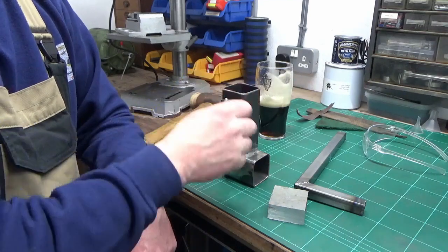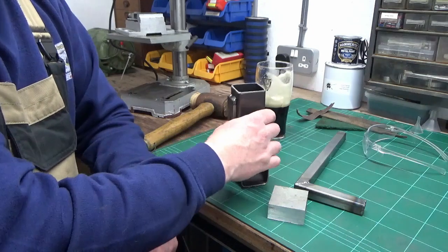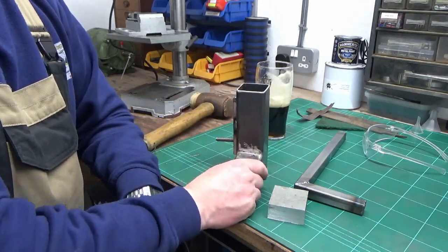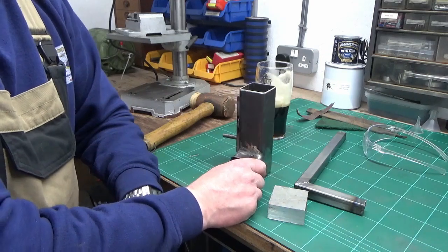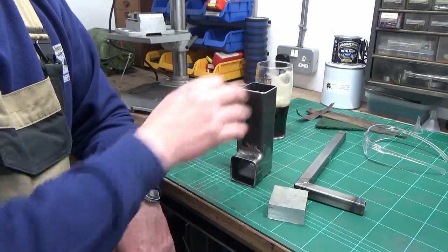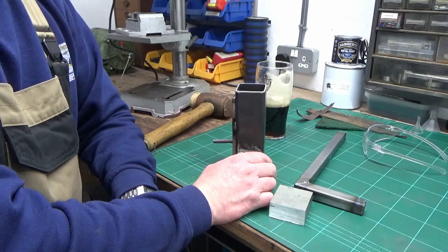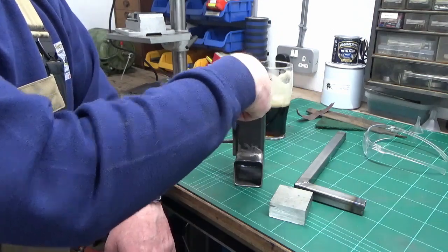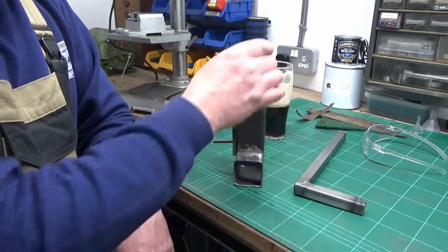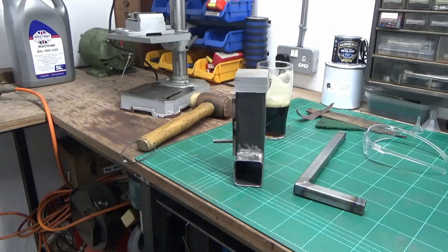and having bolts on the inside because of the grinding dust that's going to be going up through this. Any threads or anything that poke through into this inside are almost going to become useless because you're going to really struggle to get them undone at some point in the future with the grinding dust. So I'm trying to make this without any threads actually in the dirty side of the vacuum. So we'll join you on the mill and we'll start blocking that out.